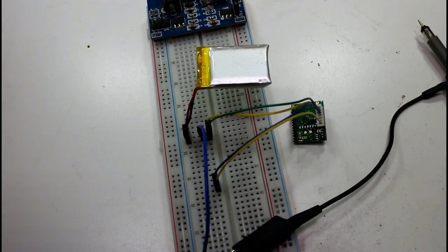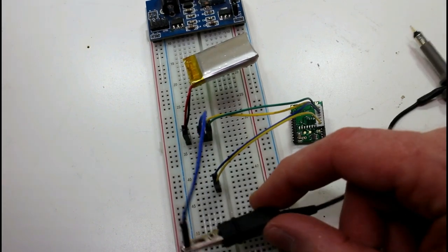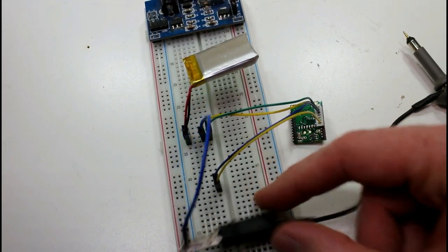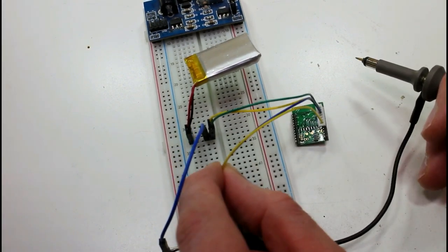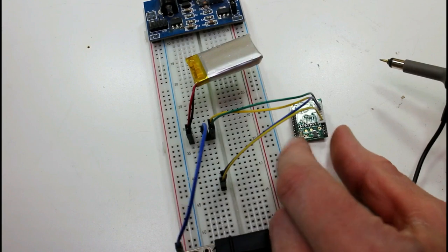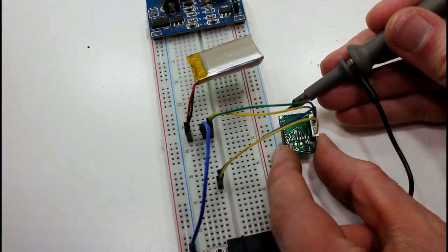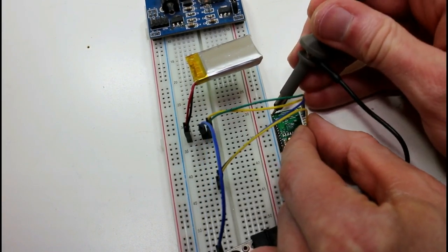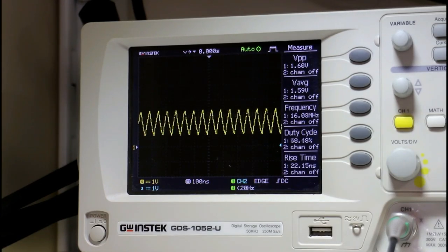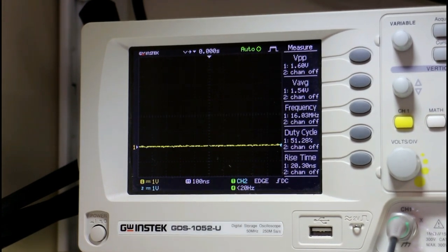Here's our finished board. We're hooked up with the LiPo battery, we have the oscilloscope hooked up to a ground signal with the blue wire, and our PCB is hooked up with the multicolored wire. We're going to probe on our new test pad pins, which we didn't have before. The one at the top is for the clock signal, which is the one we're most interested in. Looking at our signal, we can see our frequency there is 16 MHz — exactly what we were looking for.